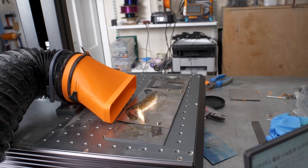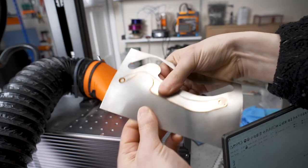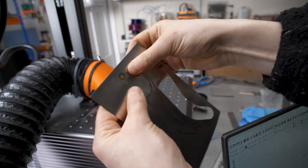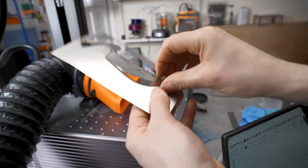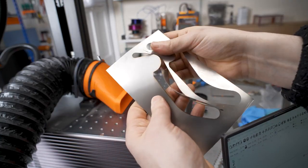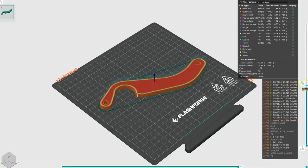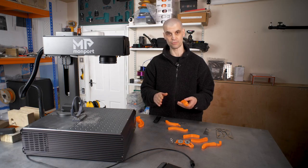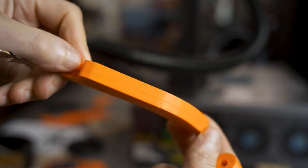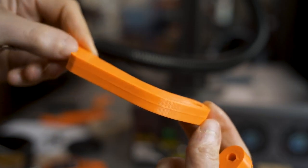I'm actually quite happy with that result because cutting out the solid steel sheet — without trusses — is quicker and there's less post-processing to remove all those triangles. The mid-print reinforcement style was easier than expected. In Orca Slicer you just right-click to add a pause in the g-code, then put a few dabs of superglue, push the metal down, and hold it for a few minutes. With the 5M Pro there's a tiny bit of layer shifting but it's really minimal and the prints turned out nice.